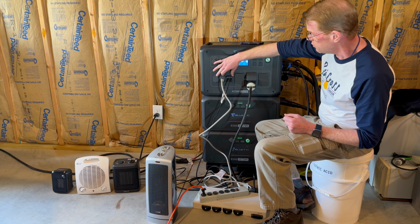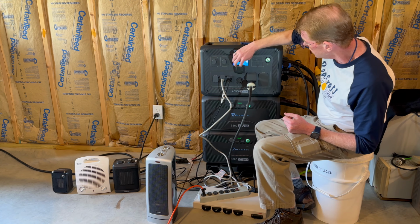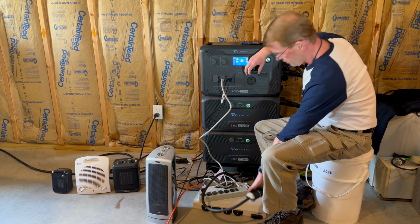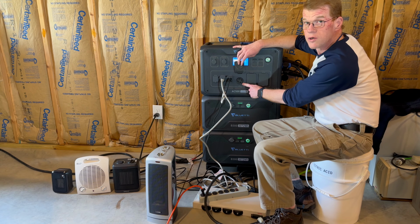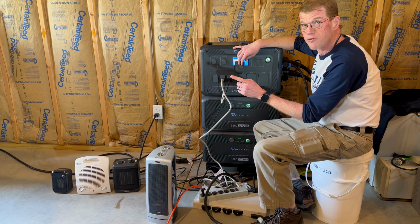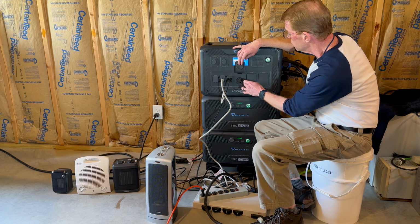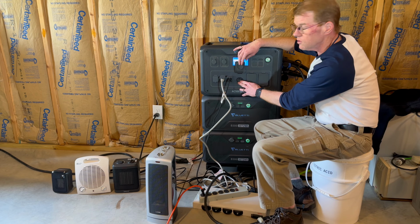You get three standard 20 amp, 15, 20 amp combo, North American plugs. You get a L14-30 outlet, of which only one of the two, let me get that out of the way, doing some mock-up. So you get an L14-30, which is a 30 amp, 240 volt twist lock outlet. This is the same as is on the back of my house for my generator interlock, but only one of the two hots is energized. I have not tested to see which one it is, but it's only 120 volts, but they're using this to get the amps, 30 amps.